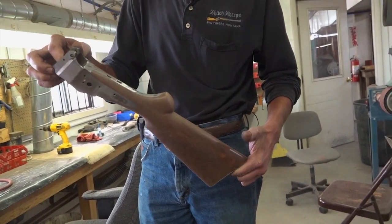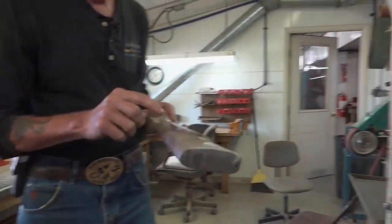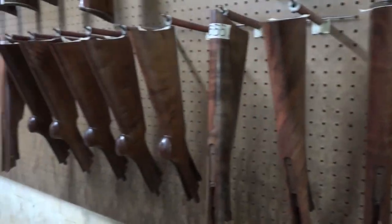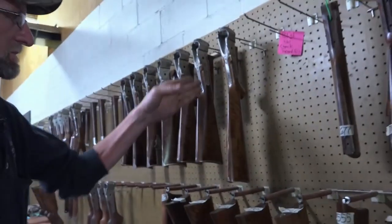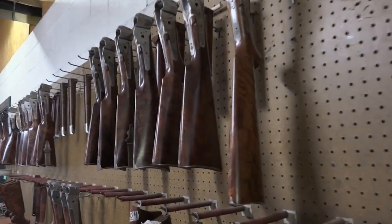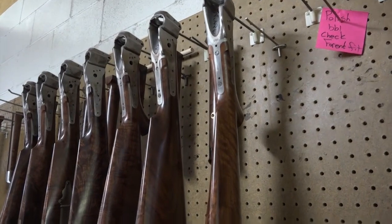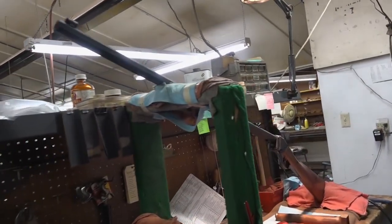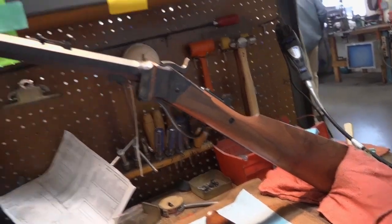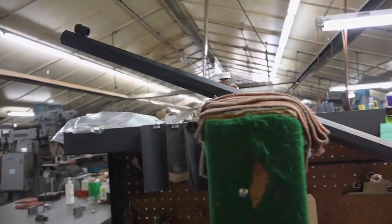This is the woodwork — these accent lines are all hand-filed. If a person wants a double-AAA finish, the gun is put back together and hand-sanded with 1,000-grit and oil until it gets a nice sheen and all the pores are filled. This is the area where the final gun is assembled, inspected, and tagged before it gets shipped out to its new customer.